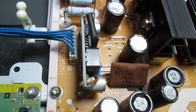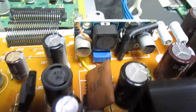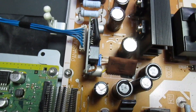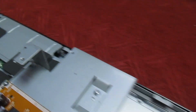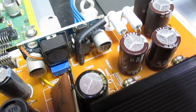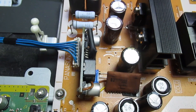I've already set this converter for 9 volts with no load. All that remains is to set it for exactly 9 volts now that it's in the TV. There's an adjustment down there which I can just get to with a screwdriver — that's the potentiometer — so I'll just tweak that to get exactly 9 volts. I'll do that now and then we'll see what happens.